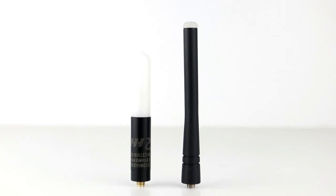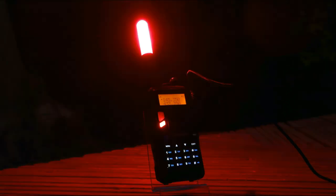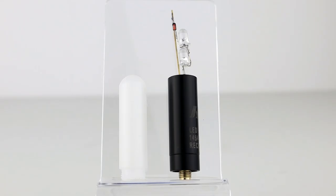So there you have it — a quick look at these LED antennas. One thing I should point out is that when I bought them they weren't cheap either. I may have had a bad batch, but it's likely these are suffering from the same problem: the LED soldered directly to the antenna's radiating element doesn't do it any favors whatsoever. This may just be coincidence — they may just be poorly made antennas — but I don't think those LEDs help, so stay clear.